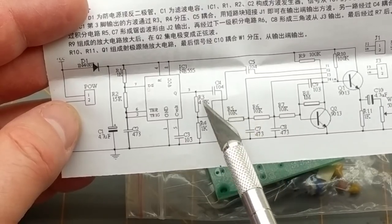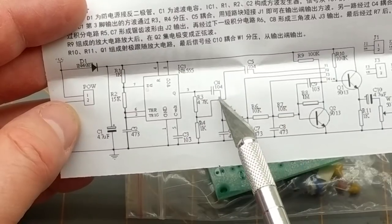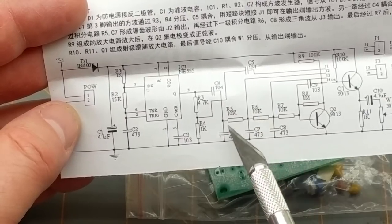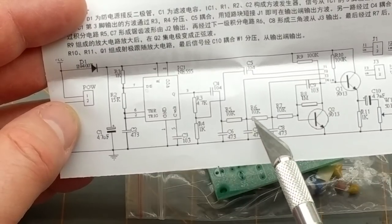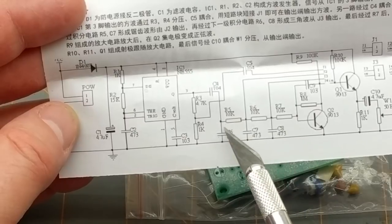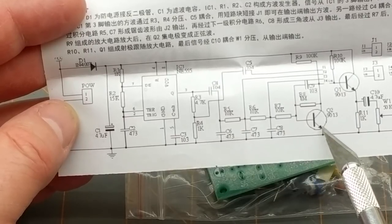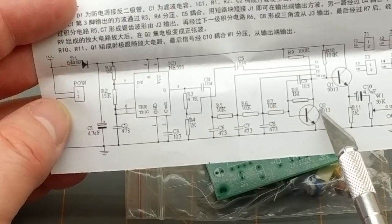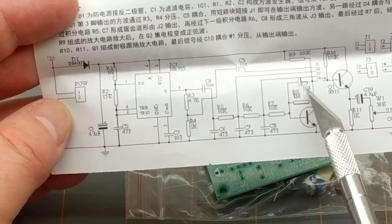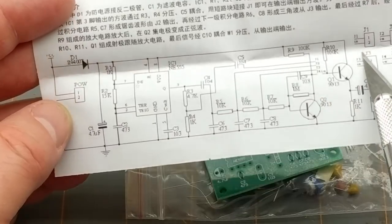So that's going to be a square wave, and before that first capacitor — which is basically a DC block for isolation — we have a resistor-capacitor network going out to J2, which also feeds into a second RC network and into a third one. The second one goes out to J3, the third goes into a transistor circuit which has a 1 meg resistor between the base and collector, and another capacitor going to J4.